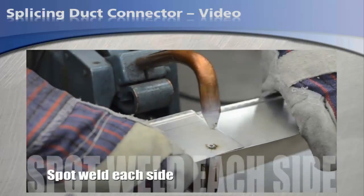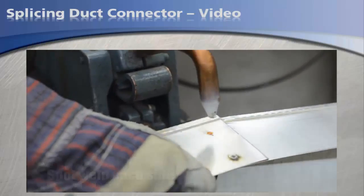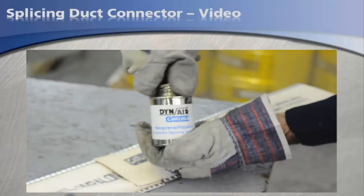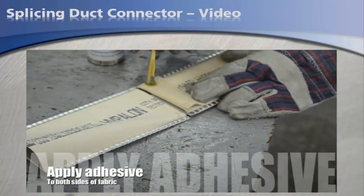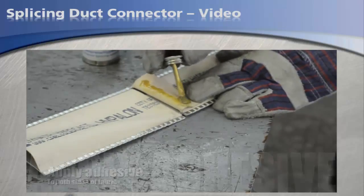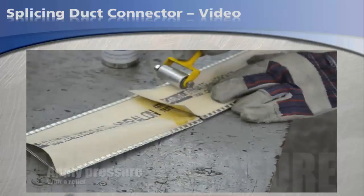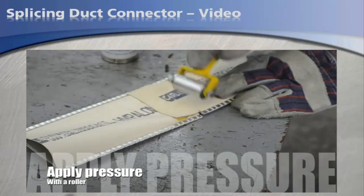You then want to spot weld those sections together. Now if you're doing this in the field, you're basically just going to be screwing those two sections together. The next step is going to be to glue that flap of fabric. We're going to be using a splicing adhesive specifically designed for Hypalon and Neoprene connector. Notice how we're applying the adhesives to both sections of fabric. Once that's done, we're going to use a metal roller and apply some pressure to ensure we get a nice solid bond.